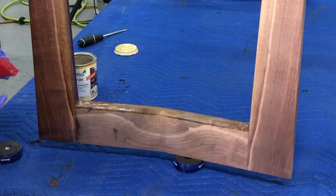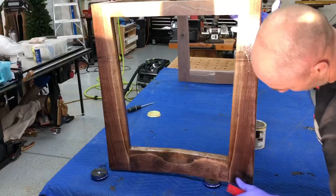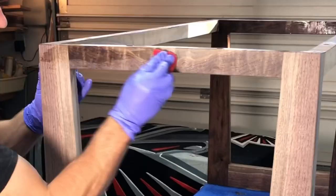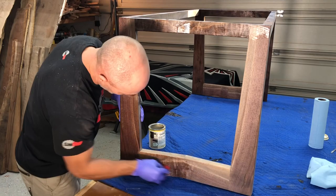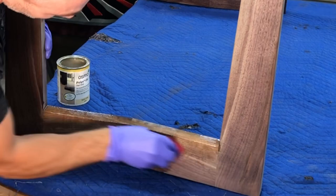I'm using an Osmo 3054 finish, which is the same finish I was using for my top. It's a really easy to use, really nice finish that you can get completely dust free — not like a polyurethane where dust in your shop is going to stick on it. I actually have a whole table finishing video I'll include a link to in the description. You pretty much wipe it on, get a little friction — which is why I'm rubbing it so vigorously with this red floor pad — and then when you're done, you just wipe it off and it leaves a perfect finish.